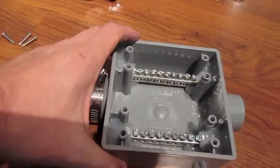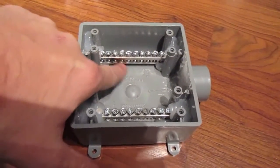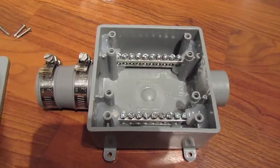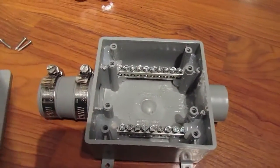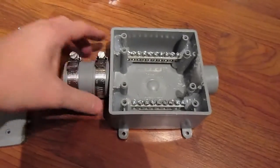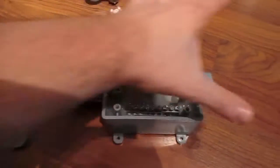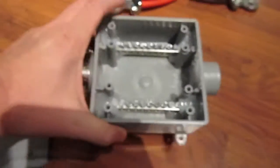I'll mark them before I put them up there. All the panels come in on this side, and as I bring them in I'll again put them to the positive and negative. This is where I'll feed everything in from the panels, and this takes it down and into my battery bank — or a combiner box, as people call them — to combine all your solar panels into the one cable coming to the house.